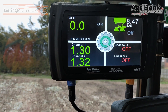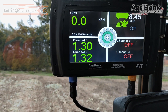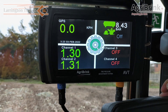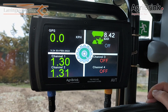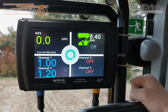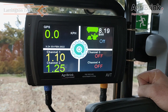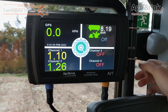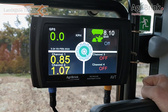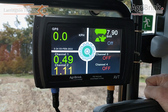We've just come in from the field and we've been going down the road with 1.3 bar in the tractor — very stable, so you're around about 17–18 psi. In the field now we're going to instantly let it down. Peter's going to pull the switch at the side down. That's what we call medium pressure, so it immediately goes down to 1 bar and 1.2. And we go down to field pressure — half a bar in the front tyre and one bar in the back tyre.